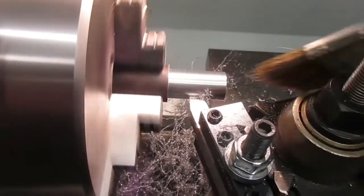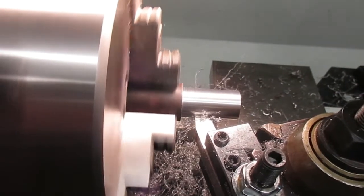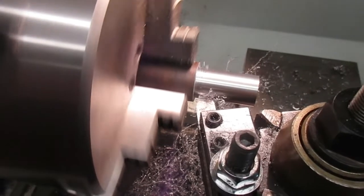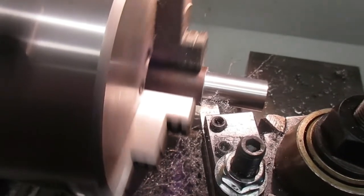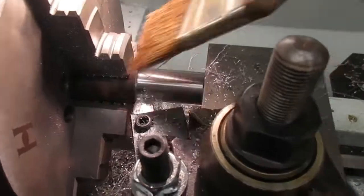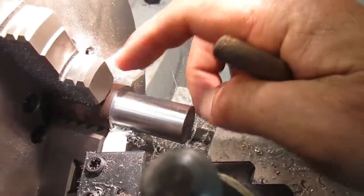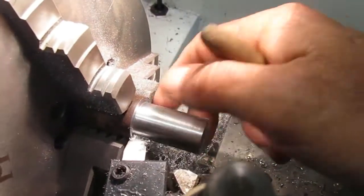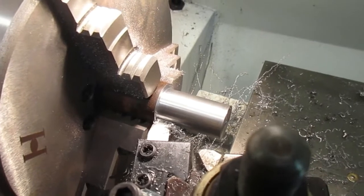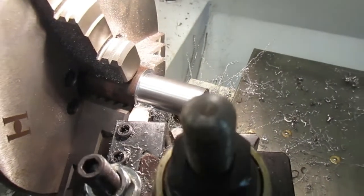It shows you just how fine that grind will cut. It's a pretty good grind — I've been happy with it. Need to modify it a little more, but it takes a while to figure it out. No feathering — man, that is smooth. Give it the old fingernail test. That's nice. It's good for pins and things like that. You know, if you've got to work with this stuff you need something fairly smooth that isn't going to wear your bore out. Try that with carbide and you've just got a stinking mess.